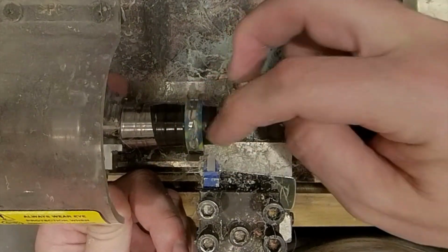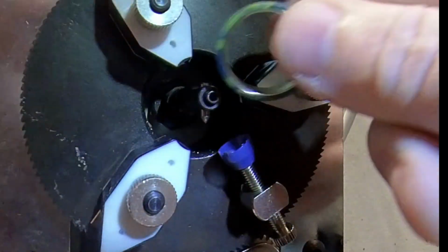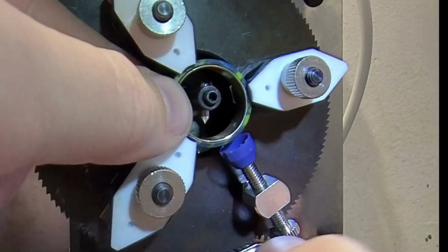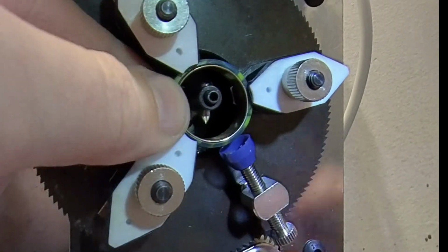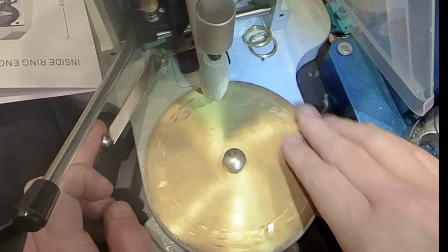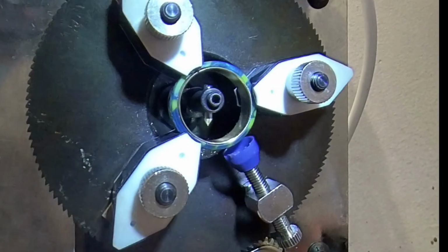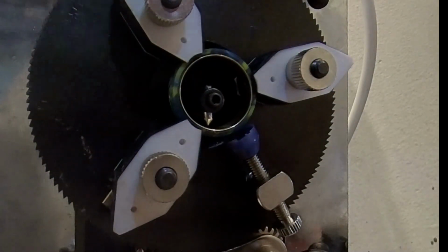Once this is done, I do some etching on the inside. So this is an etching machine, and it's a manual etching machine. It's basically a copy machine. I have letters and numbers on a dial down below, and once you do those, you're going to see the edge in the middle there go down and etch on the metal or whatever I want to etch. So this is quite time consuming, and it's not a perfect science, and you have to be aware when you do this so you don't do too much damage to the metal.